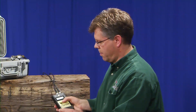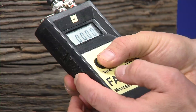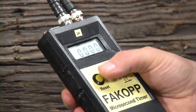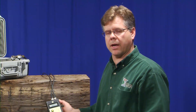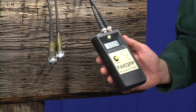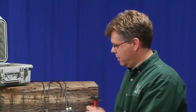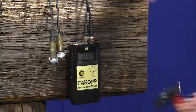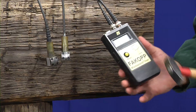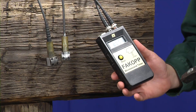As we start the equipment, we want to hold the reset button when we turn it on. This allows us to automatically reset the data each time we hit one of our tools. One of the things the inspector has to make sure is that they've got the probes connected to the right location. If after inserting the probe into the member we find that we don't get any measurement at all, we've likely connected the probes to the wrong connections.